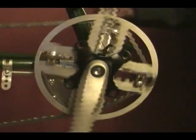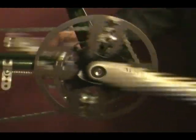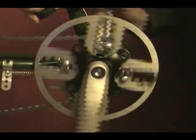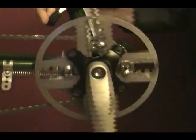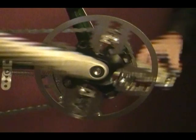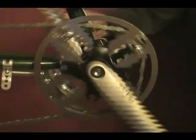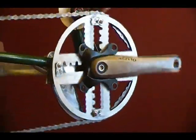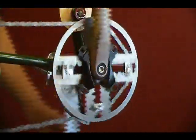The working model was only meant to show that effective gear radii could be adjusted while the model was being pedaled. Much of the unevenness in the operation was due to the loose tolerances and significant play in the surfaces of the control elements. Another factor was that the model is a tabletop mock-up of a bicycle frame, so movements of the crank arms tend to make the whole model less stable. I have been refining and tightening the construction of the original working model and the present version runs considerably more smoothly.